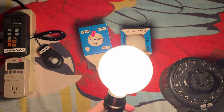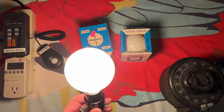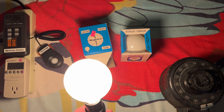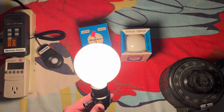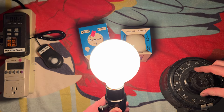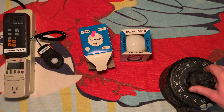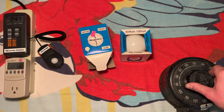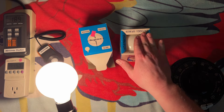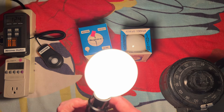Let's turn it on. It's at 120 volts right now — I measured 119 out of the wall. The original marking was right here in the middle but I moved it a little bit to get more accurate readings. So if we bring it up to 130 — this is 130 volts, just what it was designed for. You can definitely see from 120 to 130 a difference in the light, it's not much but you can definitely tell. Bringing that voltage down — being 10 volts higher on the package is definitely going to make the life longer, but of course brings the lumens down.